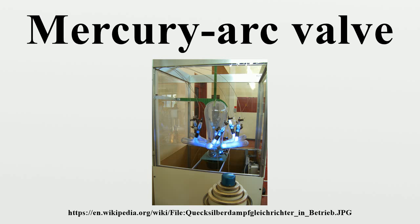As solid-state metal rectifiers became available for low-voltage rectification in the 1920s, mercury arc tubes became limited to higher voltage and especially high-power applications. Mercury arc valves were widely used until the 1960s for the conversion of alternating current into direct current for large industrial uses. Applications included power supply for streetcars, electric railways, and variable-voltage power supplies for large radio transmitters. Mercury arc stations were used to provide DC power to legacy Edison-style DC power grids in urban centers until the 1950s.